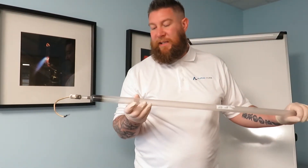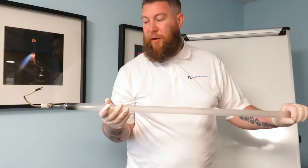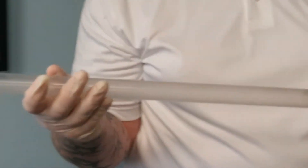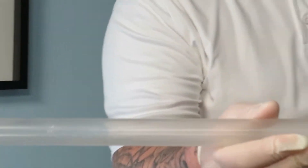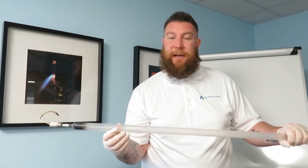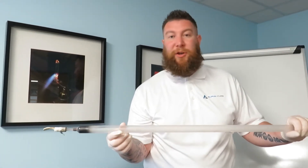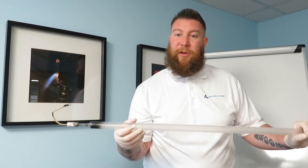The last thing to check is the airflow on your system. If you have contaminated airflow or airflow not flowing properly, you can get what we call de-vitrification along the length of the lamp. This basically turns the quartz back to its original state and it no longer transmits UV as well. Therefore you don't get as much UV out onto the substrate.